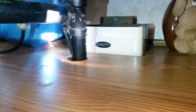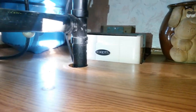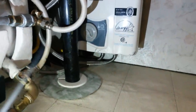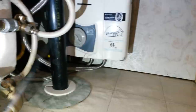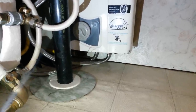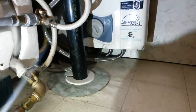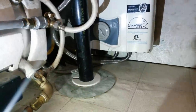On eBay you can get a refurbished one for under $150 — this one was refurbished. Excel sells two different versions of the small unit. One has a battery power, which I bypass and hook straight to a 5-volt USB power supply. The other version is powered by a little dynamo: as water flows through the system it turns a small dynamo generating electricity, which is stored in a tiny battery used to ignite the system.